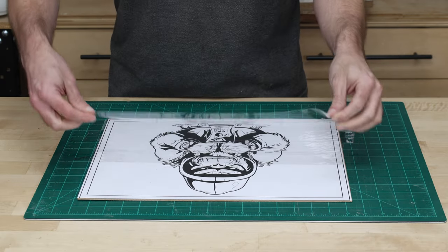I think that looks good — pretty happy with the cherry. Now it's time to do some actual scroll sawing. I've printed off my template — at least part of it — and I'm going to start with the hoodie, using walnut as the darkest color. This piece of walnut is about a quarter inch thick, which will probably be the thickest material I'll use. I'll cut out that piece with an exacto knife, put some contact paper over my board, spray my paper with Super 77 spray adhesive, stick it onto my board, put a little packing tape over that, then start cutting.